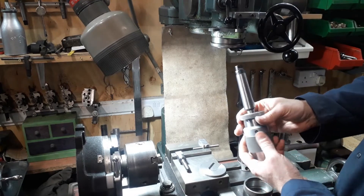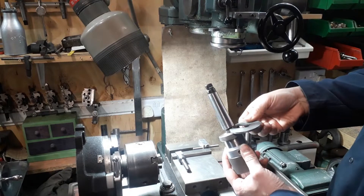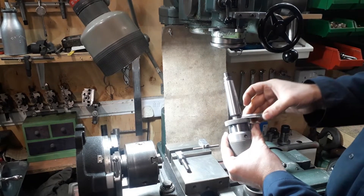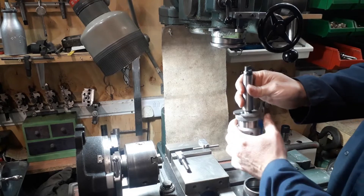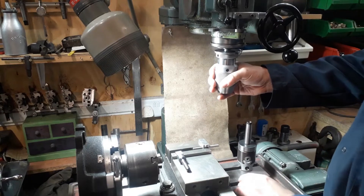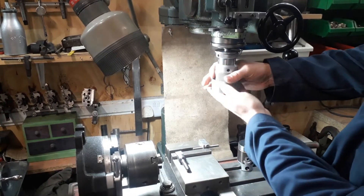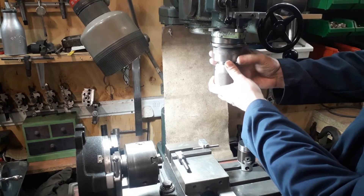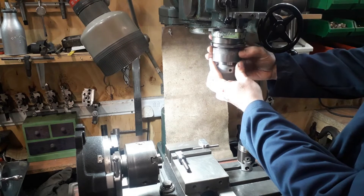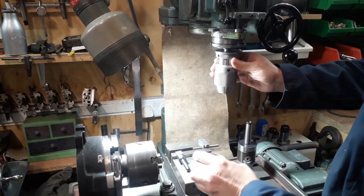Because of the Arboga's compact head, they've come up with their own idea, which basically works with a little finger plate like this, which slots into a groove at the bottom of the taper. That then goes into the head of the machine, and you have a ring — there's a thread on it — the ring goes over and onto the thread, which then pushes onto that plate, and that's what holds it into the headstock.